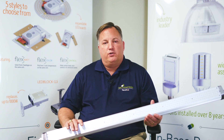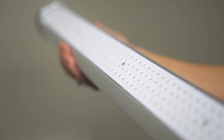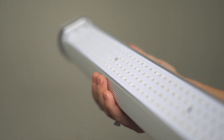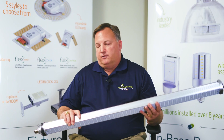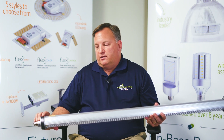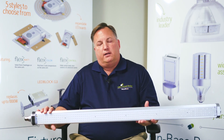This is our LED-8104 product, about 44 inches long to go in the same size as a Sox lamp. It has a lot of the features of our standard HID retrofits, although it looks a little bit different. It still has active cooling, so you'll see down here on the end is the input, and then there's an output for the air to be able to cool the LEDs.